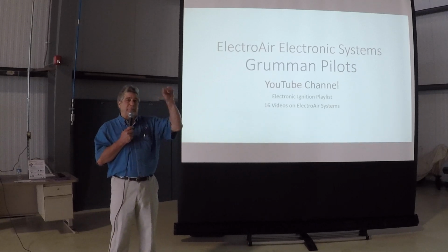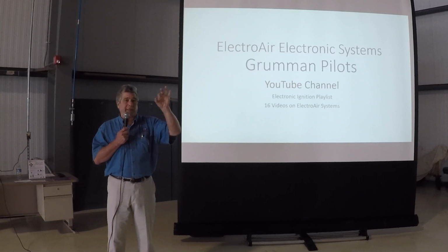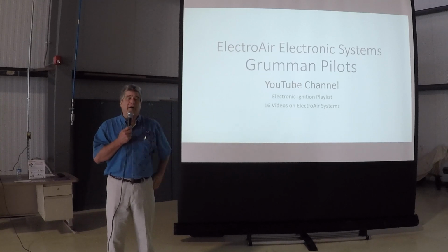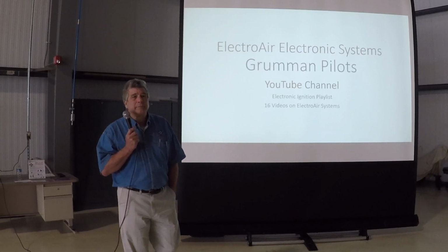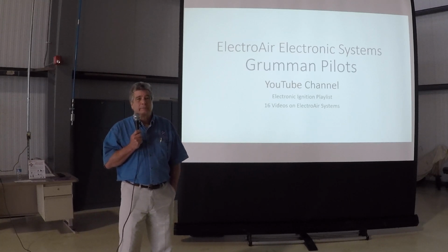You can have the 37BY style plugs. You can have the 38E style, massive electrode, they're just gapped differently, and they also have a fine wire solution. Well, I asked that question because at 70,000 volts, I would imagine that the massive electrodes will have erosion even at a faster rate than you would with a standard magneto.